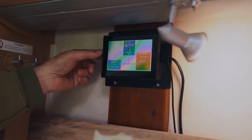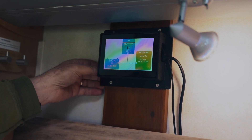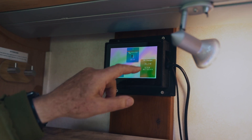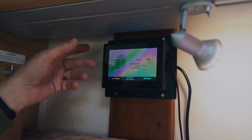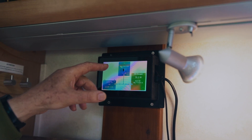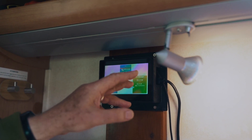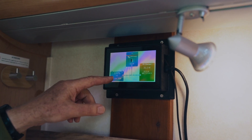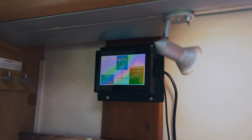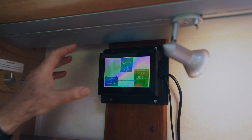Before we complete all the tidying, let me run through everything here — for anyone who hasn't watched the first two parts. We have the Raspberry Pi mounted in this DIY enclosure with a touch screen in front of it, so it's fully interactive. GUI Mods is installed so you can click and see detail. We don't have a Multi Plus or Victron inverter, so those disappear in GUI Mods if not connected, which is quite nice. This gives Nigel the info he needs: the state of his battery, the state of his solar. It's connected to VRM so he can see it online from his armchair and set alarms to monitor his engine battery.